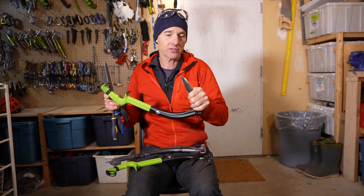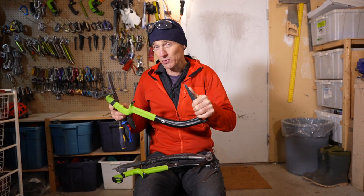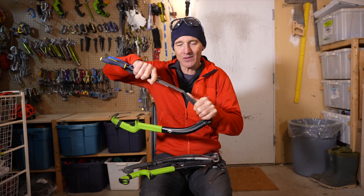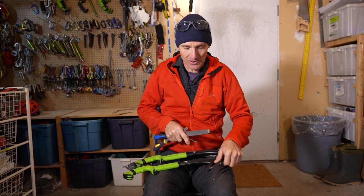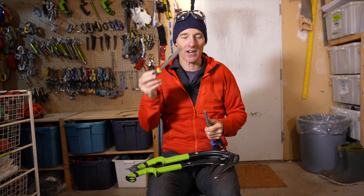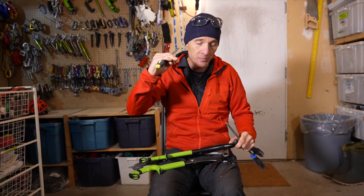This pick has been brought back to pretty much factory spec - looks really good and it's going to work really well. But there are a couple of next levels to this. If you want to dry tool really hard and want a savage beak on the front that hooks on anything, you've got to increase the angle of this front tooth. I also find it useful to radius it slightly, and for that a special file comes out - it's shaped like a half moon, which allows you to radius the front tooth and end up with a really savage high-angle beak for super technical dry tooling.